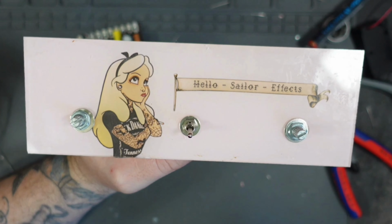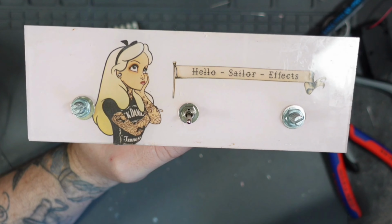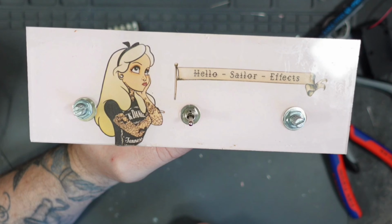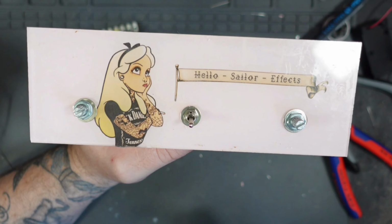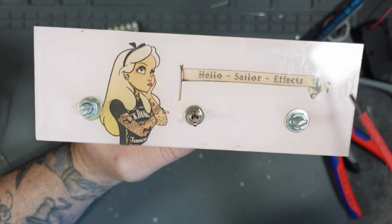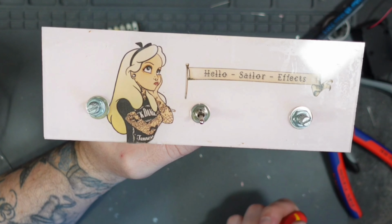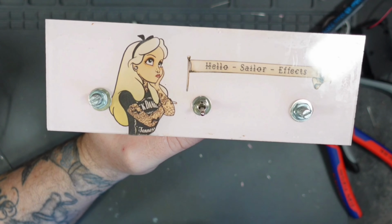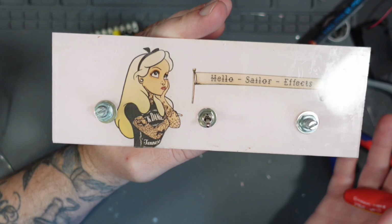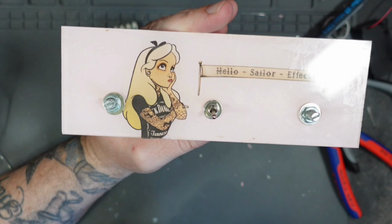There's our switch fitted. One other thing that I neglected to put in is, firstly, an LED space. So I'm going to have to drill a hole approximately about here to fit an on-off LED, which of course we've got the lugs on our switch available to be able to fit. And also I'm going to have to drill a hole in each of these 4 corners, so then I can screw this into the enclosure, because it was previously glued in or pressed in by the other components in there. Not very well. I wanted it to just sit there freestanding, holding all of our controls. So I'm going to drill a hole in each corner and just use self-tapping screws and screw it in there.